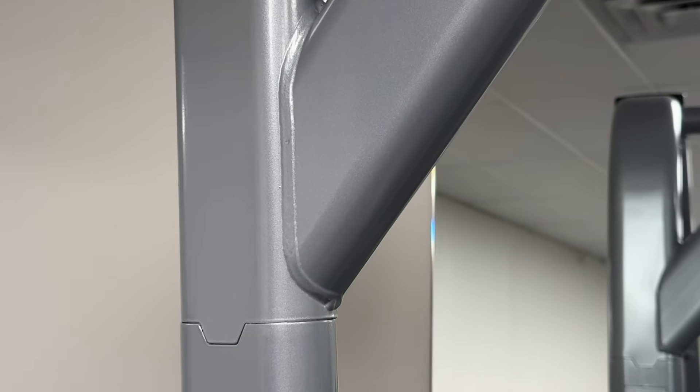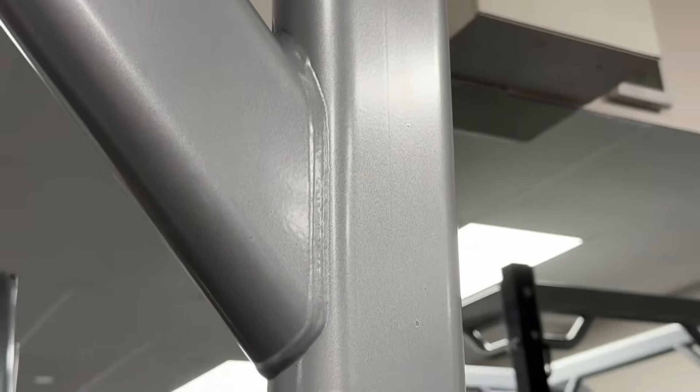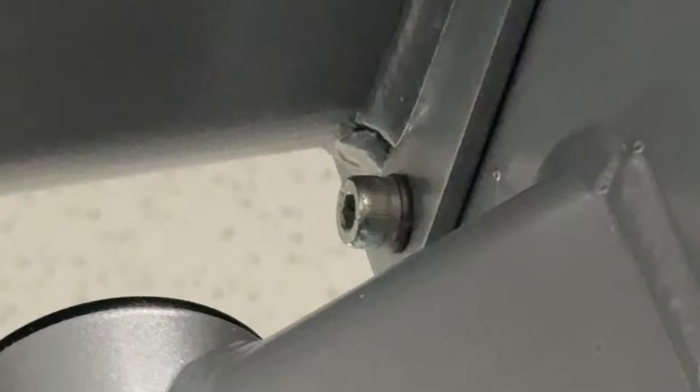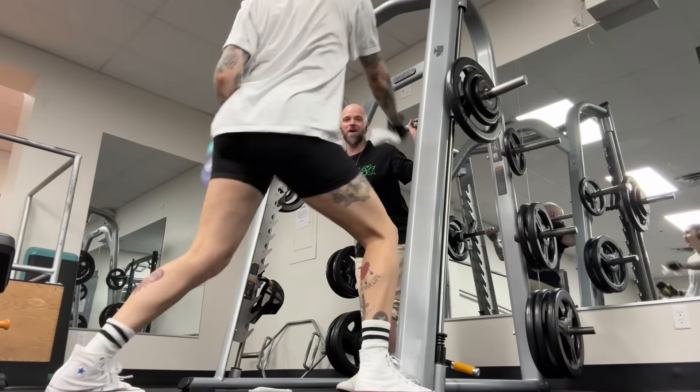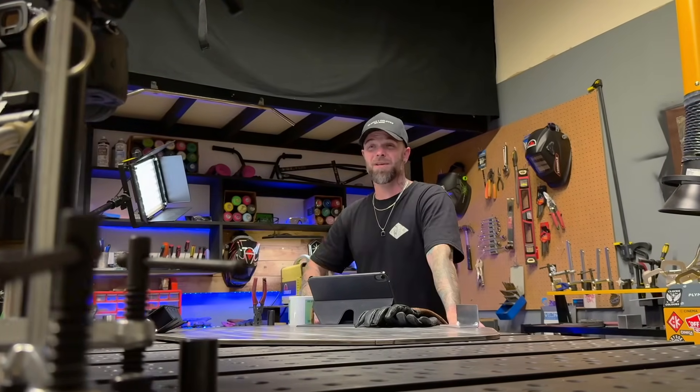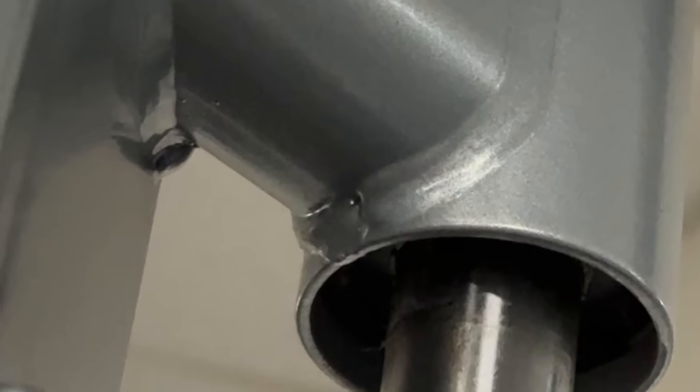This is seriously one thing I just don't like seeing. It takes such little time to just go the extra half inch or whatever you need to tie these together. The welding on this one looks really good. Could you imagine if the planning for each of these welds was to just leave a start back a little bit further? This gives you something to tie onto when you go to weld the other side, and this improves so much as far as strength and long-term integrity of the joint. Remember, in places like this gym, there may very well be lots of moisture in the air — hot, sweaty people creating condensation, which is going to cause corrosion over time, guaranteed. Taking the extra two seconds to connect these welds properly is even easier.